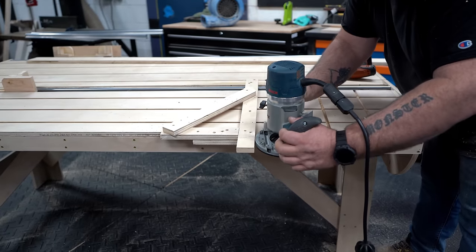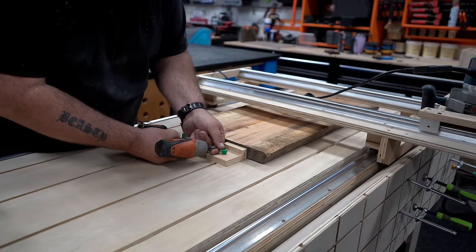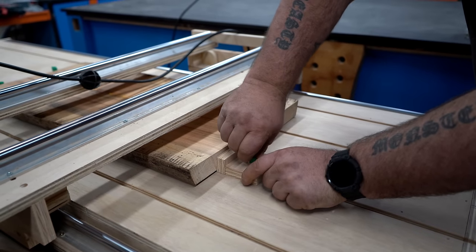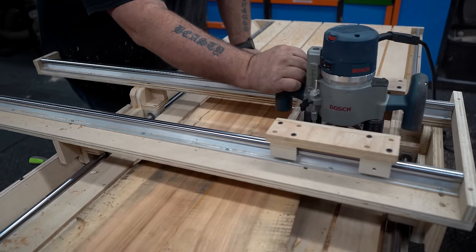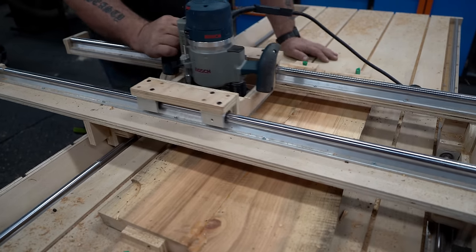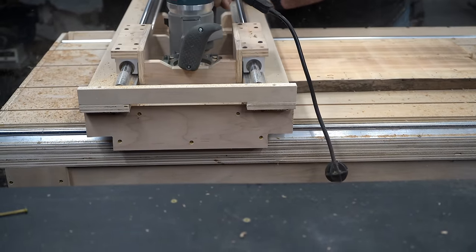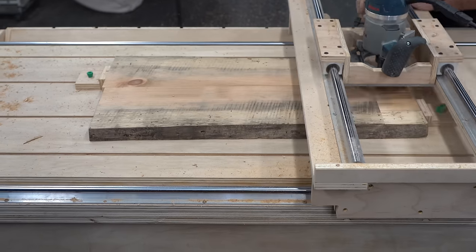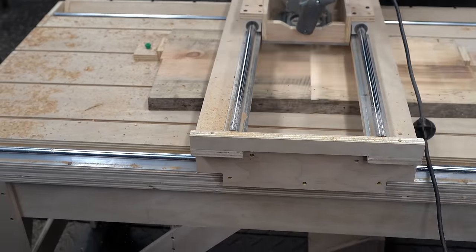I'm hesitant to take on larger projects these days because I spend the vast majority of my days in a wheelchair, and I wouldn't have been able to do this without Maggie and Gary — so thank you guys so much. The fact that it just worked so well right out of the gate was just the icing on the cake. The trim and tram on this was almost perfect right out of the gate — it was a couple thousandths off, but we're not messing with that because you can sand that out in 10 seconds with some 80-grit sandpaper. All that means is that the router bit was very parallel with the work surface, so there weren't any big humps or ridges to sand out.